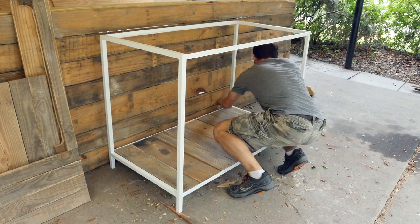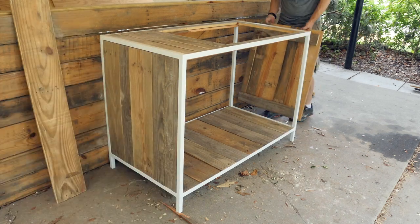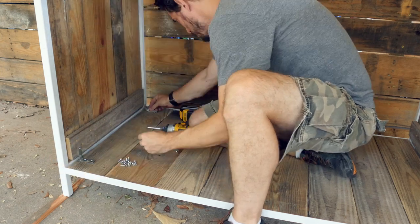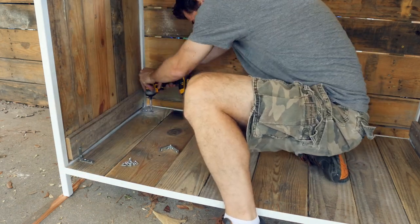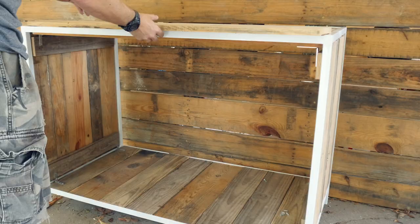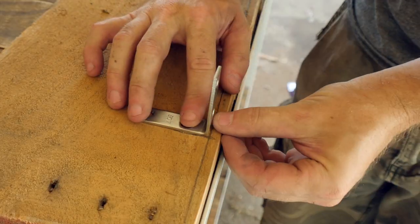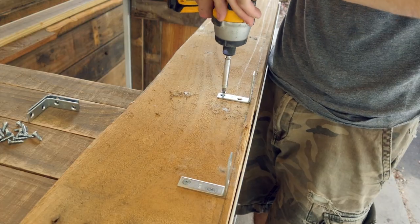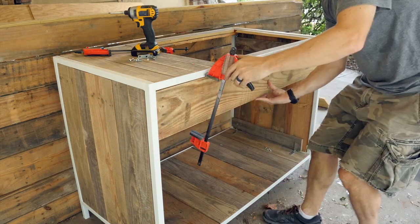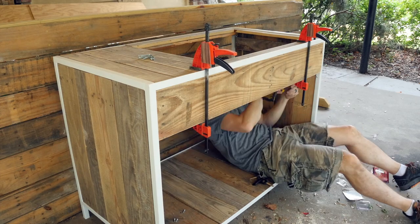Then I dropped in all the wood panels. I needed to figure out how to connect them together, and it dawned on me that it was pretty simple as long as I didn't have to worry about connecting them to the steel frame. I used some L brackets to connect the side panels to the bottom and then the side panels to the top. These are all going to be on the inside so you won't see them, and if I ever need to take this apart, it'll be really easy to do. I set the front apron in place and traced where it overlapped the piece of wood from the top section, and used this line to line up the brackets so they would sit flush against the top on the inside. With all the brackets attached to the apron, I used some clamps to hold the panel in place — not tightened down, just to stop it from falling — then screwed it in so the whole thing was secure.